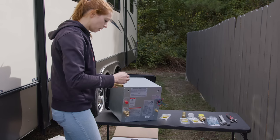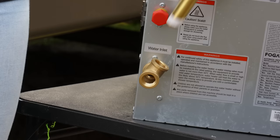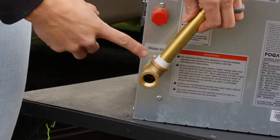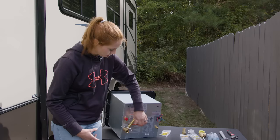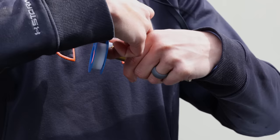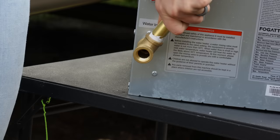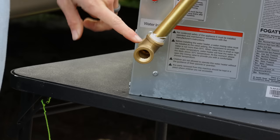Get your nipple and thread it as well. Let me show you an example of the wrong way — when the tape is threaded incorrectly and you start twisting, you can see it bunches up and pulls off. That is what you don't want. Unthread it, take it off, and re-thread it the correct way. When threaded correctly, as you tighten it the tape is not binding up — that's exactly what you want.